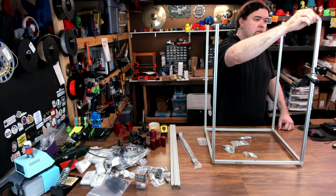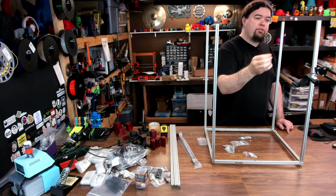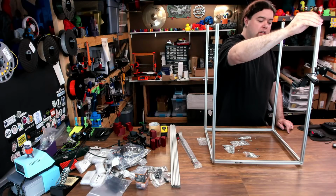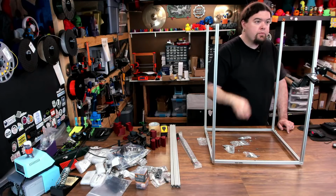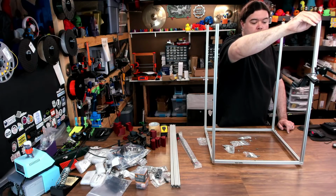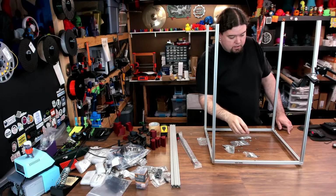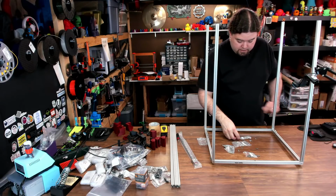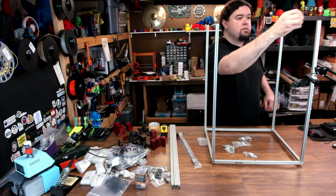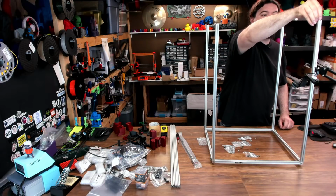So the rail actually goes on another one that sets in the center. On the 15 extrusion, they're so small that they capture M3 nuts. So that's all these are. The only screws that matter here are the ones that hold the panels on the outside. I'm just throwing in extra ones on the inside extrusions, so that in case you want to mount something else at a later time, you wouldn't have to take anything apart.